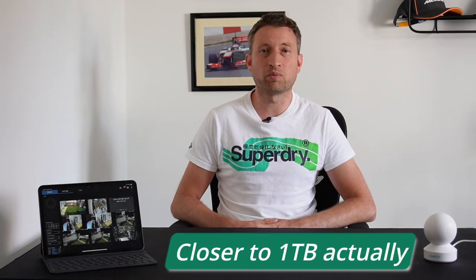What some people do is they set up motion detection to record the substream, which is of lower quality. And then when it detects motion, it records in full quality. It's up to you. I personally do 24/7 for full quality because it only uses up a couple of terabytes of data for 20 days worth of footage on about 5 or 6 cameras. So for me, I think that's worth it.